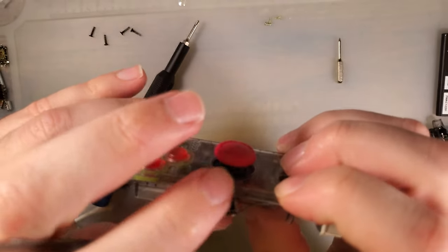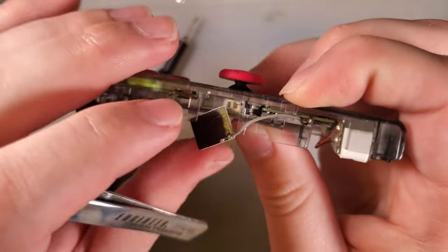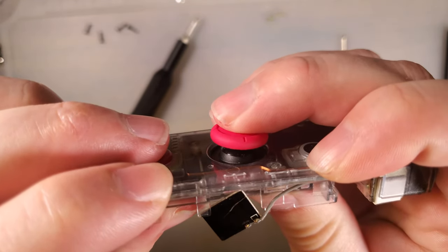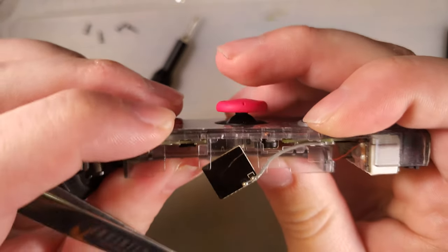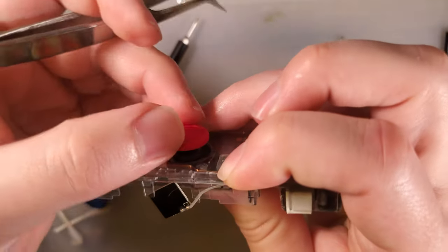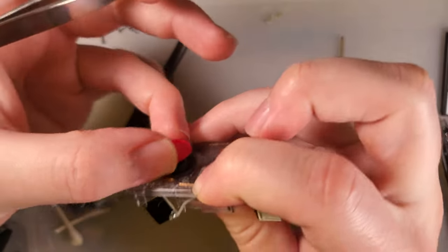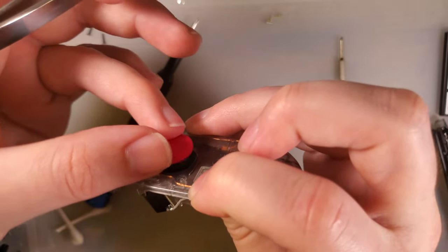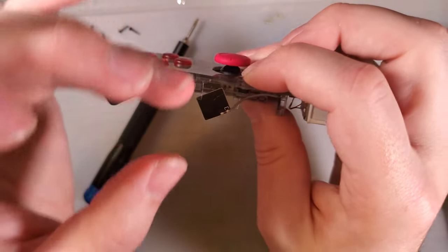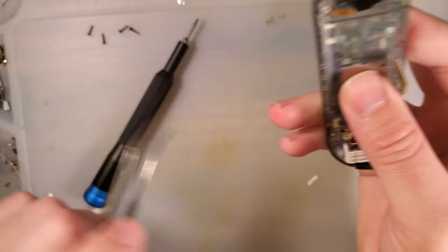You might have watched me do this earlier, but I didn't clamp down the screws on the joystick. I actually left them quite loose so that if you were to press down on this, we're not putting pressure on the screw frames. The screws are just holding the whole unit in place for twisting forces or really rough play. But if you were to actually click down, it should be pushing the whole unit down into the battery frame here.